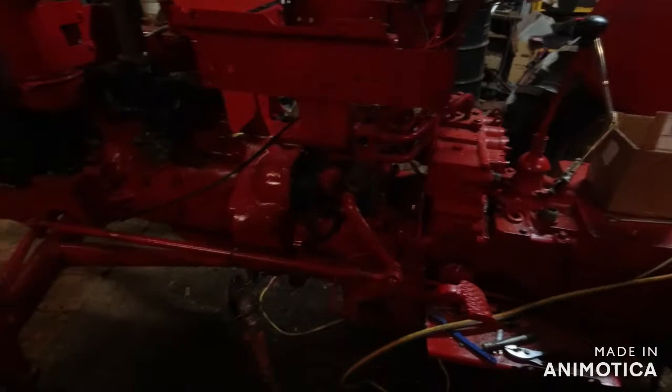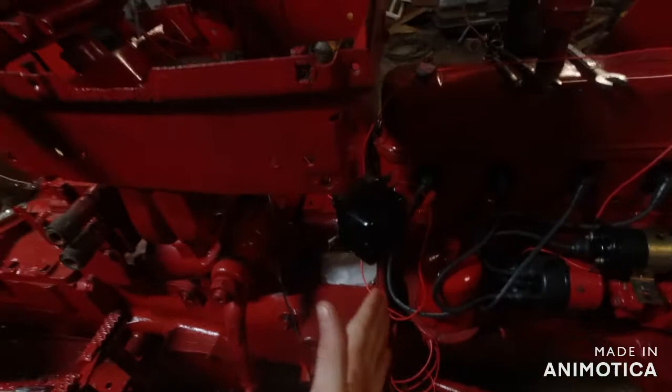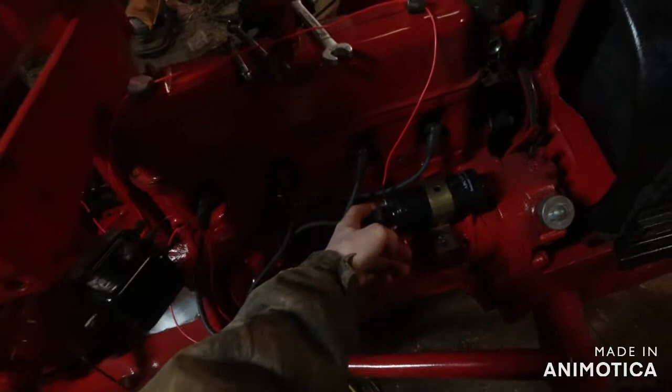But another thing too, that's nice about them junction blocks, let's put one in here somewhere, right where your tractor splits. That way, if you ever got to split your tractor, just undo the wires and the whole thing comes apart. Although, like on this tractor, it'd be pretty easy because I only got to unhook this wire here from my distributor, and then I'll have my headlights.